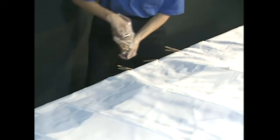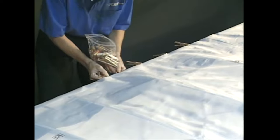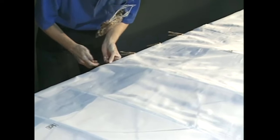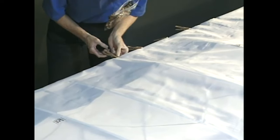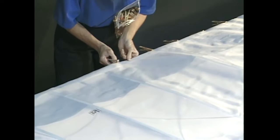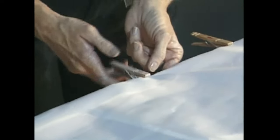Position the wing top side up and place the fabric on the wing. You will now need lots of clothespins and spring clamps to clamp the fabric in place. Be sure the fabric rests smoothly on the surface and is clamped in place exactly in the position it will be cemented. You will usually have to reposition the clamps at least once before you are ready to cement. Keep at it until the fabric rests smoothly on the surface.